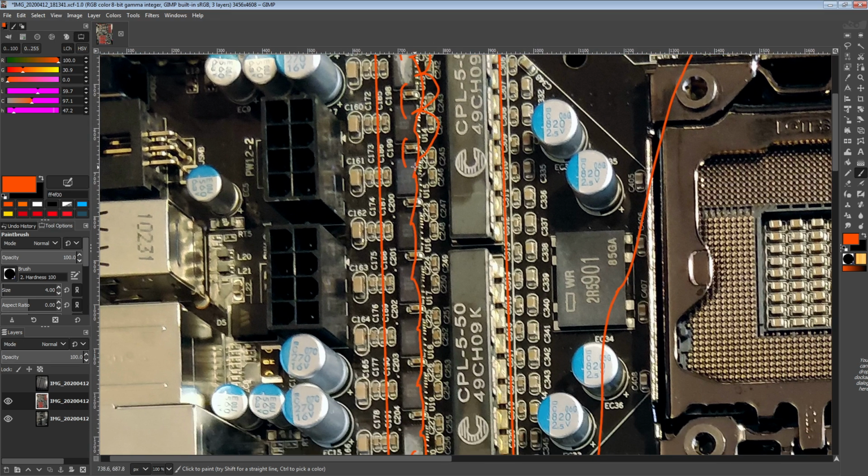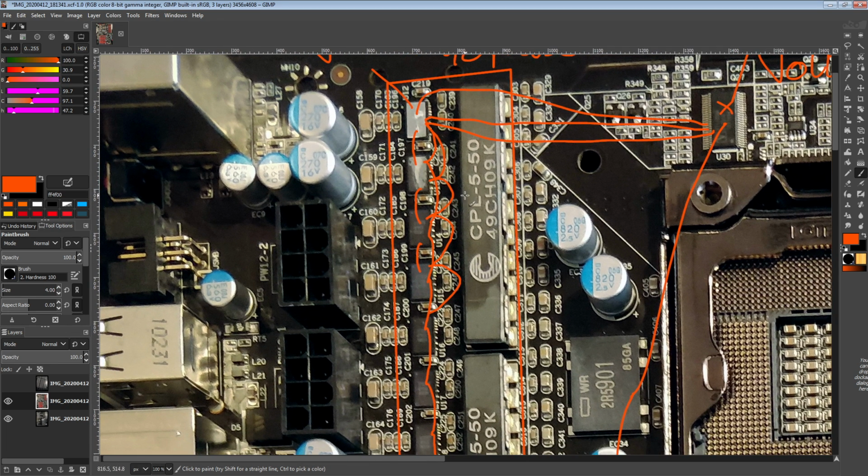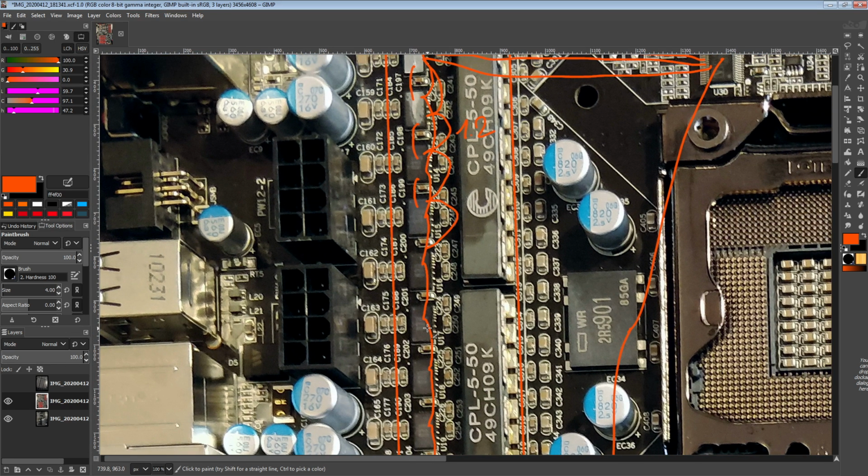Essentially, you have another connection that goes to every single smart slave, and there's a voltage range on it. I can't remember the lower boundary, but the upper limit is like 1.6 volts. So the controller can say, hey, 1.2 volts on that analog line, and through some resistor set configuration, the smart slaves will translate that voltage level into a current, how much current is supposed to flow through them.